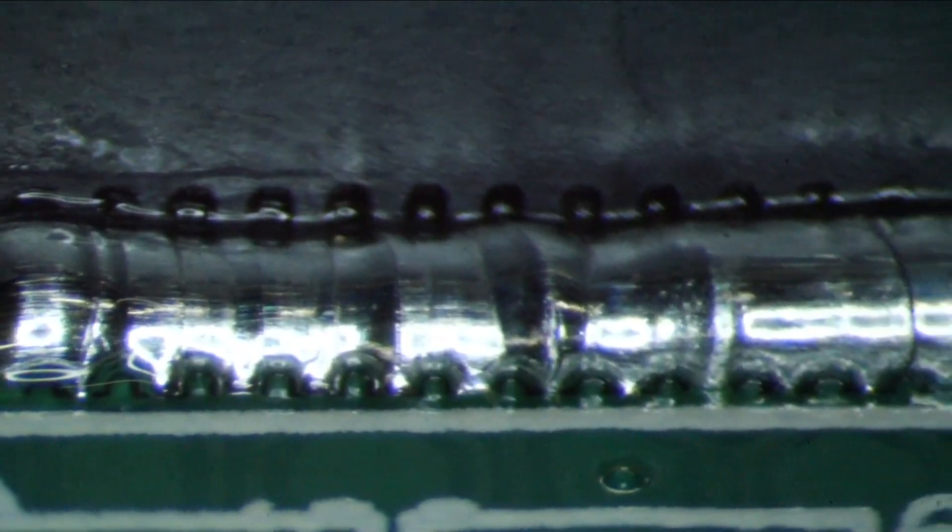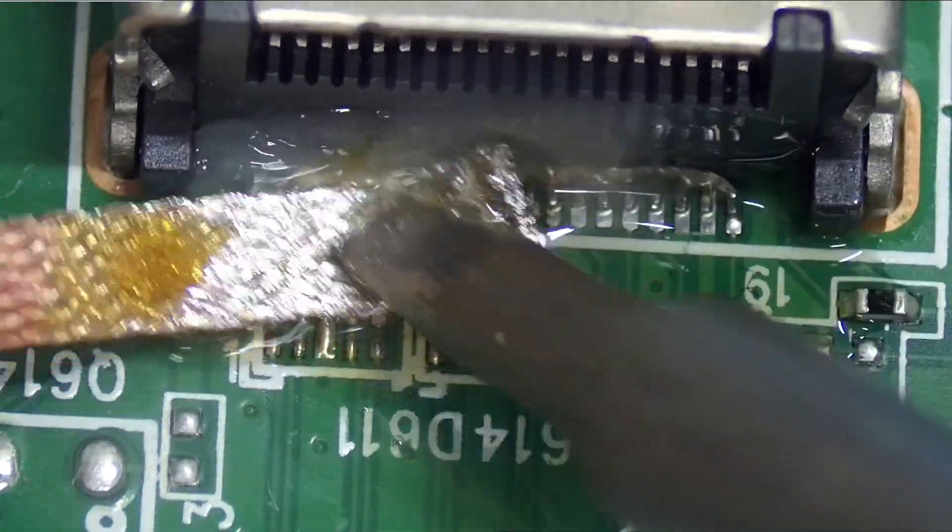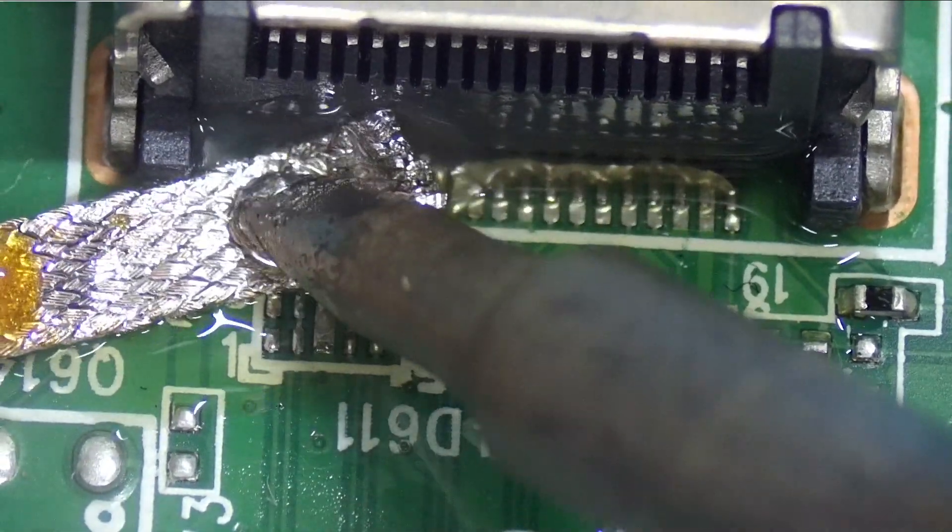Number two: let me guess, you tried to add some leaded solder to your joints and they look like this. You've bridged all your joints and now you're stuck with this large blob. Two things: don't use that much solder, and you need flux. When it comes to electronics, you absolutely need to use flux for soldering — not Plumber's Flux.